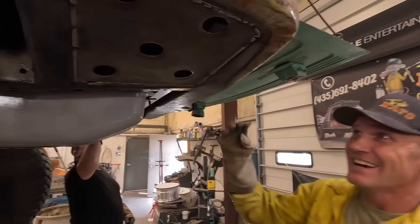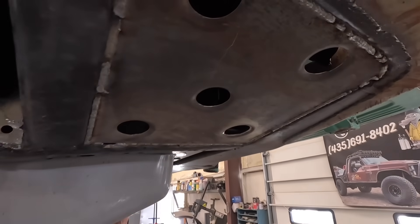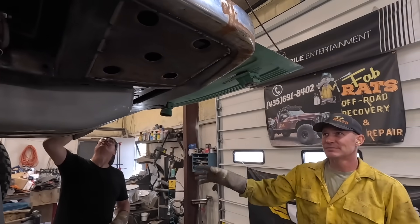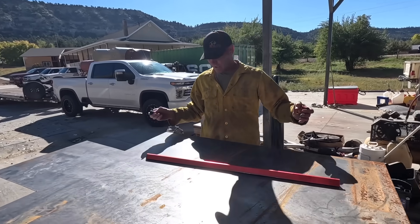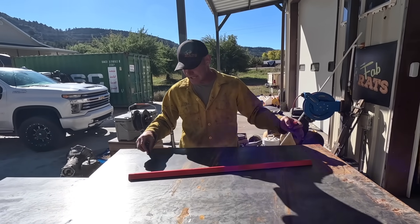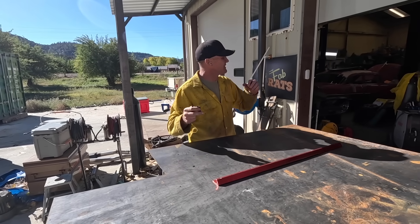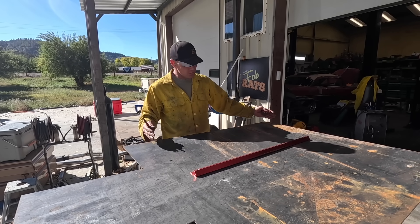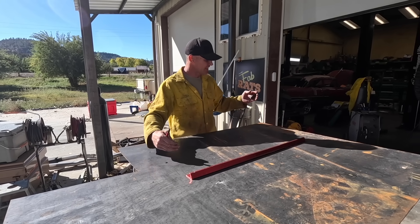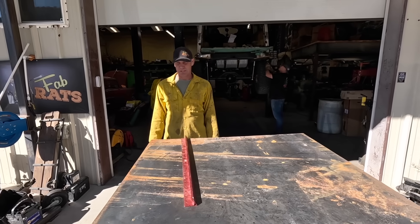One is done — that's what we want it to look like. Looks bad to the bone. We'll get the other side cut off and put in here. We're cutting the rest of the pieces out. This is 10-gauge material, which is plenty tough for the sides of this, so we're building the boat sides. We need a 44 by 13 by 9 and a quarter — it's going to be kind of tapered, but it should work out well.